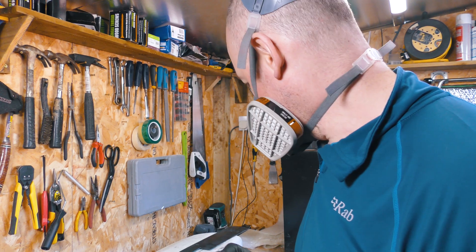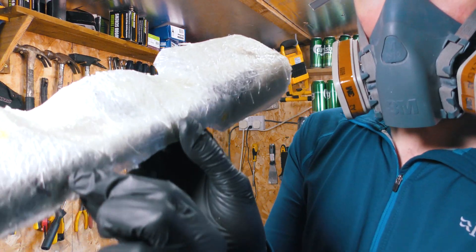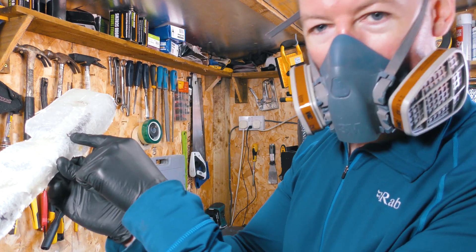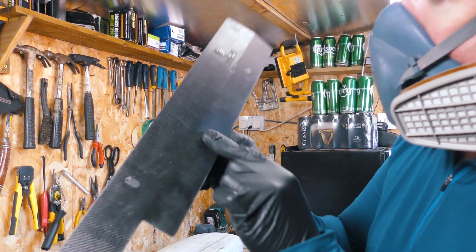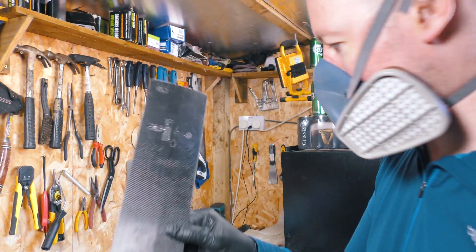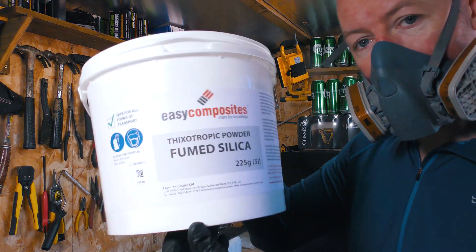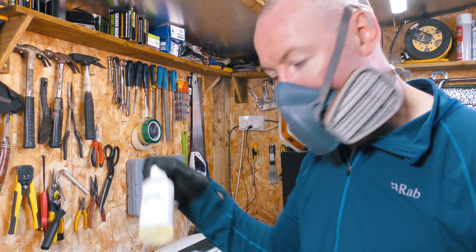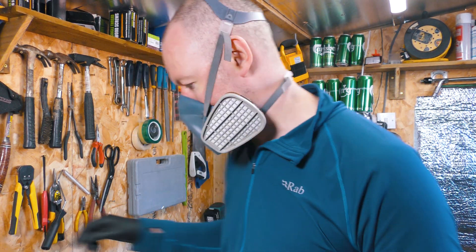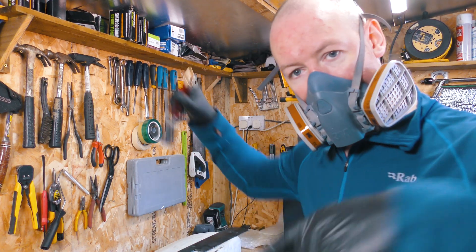So mask on, gloves on. I have three brief missions from this next batch of resin. I'm mixing a batch of resin and then trying to knock out several tasks at the same time. I'm going to fill in a couple of little pinholes in this mould — I've marked five spots where I need to put more resin into these tiny little pieces of chop strand. And then I'm going to make a putty out of the epoxy resin using this fumed silica. I have to do all of that in about 17 minutes before the epoxy hardens.